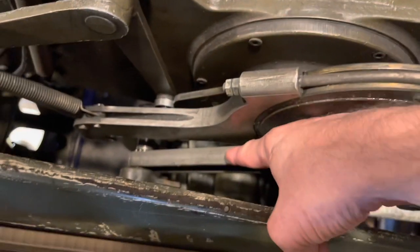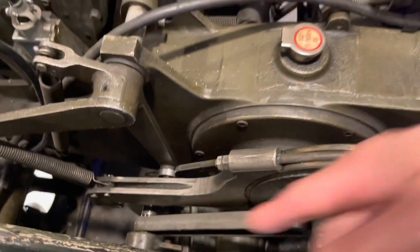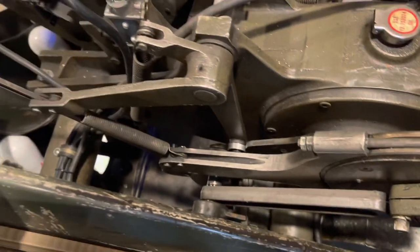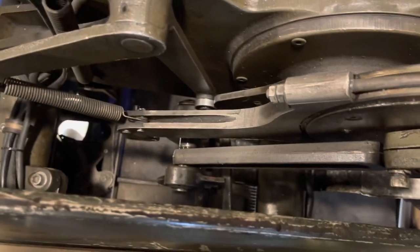Just right here is the deck lowering — that's what makes the pin setter go all the way down for a full stroke. This one does the short stroke on a first ball cycle. You can watch that — the deck lift shaft is right there. There's a big pin across there that's actually holding the whole pin setter up right now.